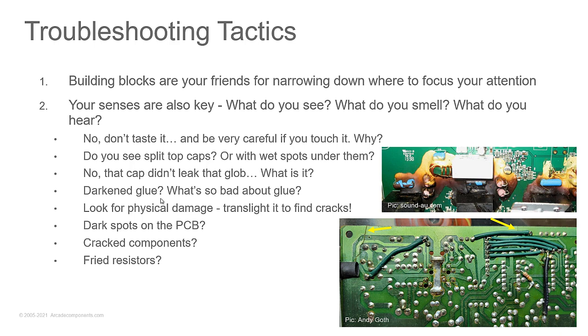And when they short, it's typically half ohm or less, unless they go leaky. When they go leaky, they can be hard to find because that means they just failed slightly going the other way. But that could still cause you to have problems like blown capacitors. And you replace the capacitor and the new one blows quickly. And you look and double check and make sure that you didn't put it in backwards.